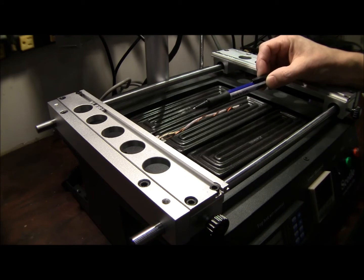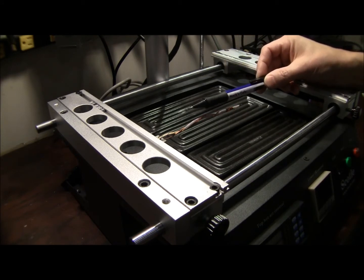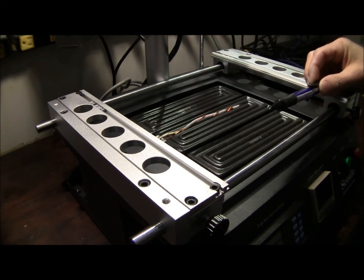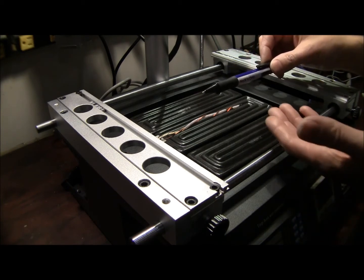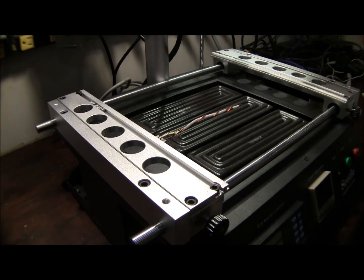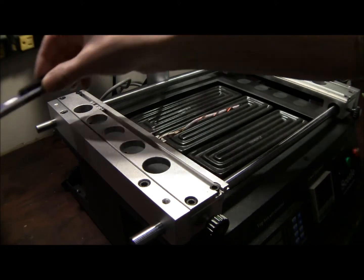The reason it's a quarter inch is that lower heaters are typically reflective — the heat isn't going straight up. Having the probe at that point gives you the most accurate reading. Having it down at the plate or off to the side is very inaccurate. Outside air is always cross-flowing under the board and mixing with the plate temperature, creating a buffer zone between your heat source and external room temperature.